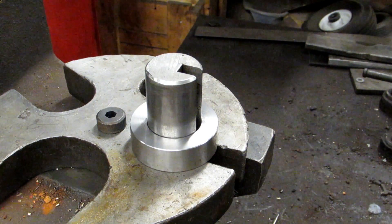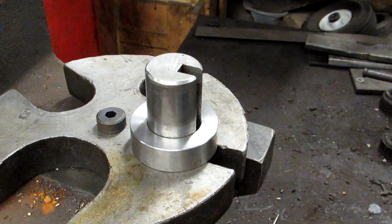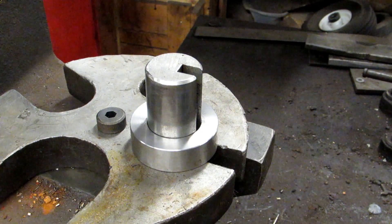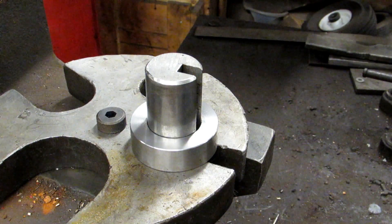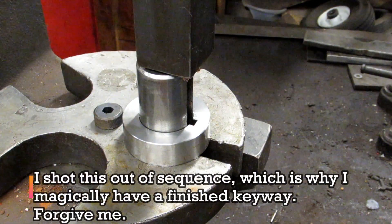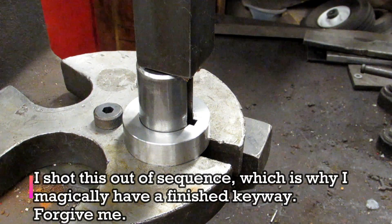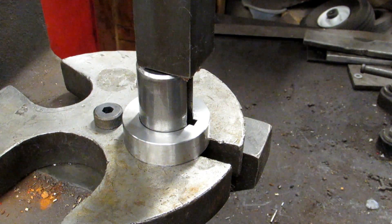You also need an arbor press or hydraulic press in order to do this. I really prefer doing this on an arbor press because you've got some feedback — you can feel what the broach is doing and you can feel when it's jammed up. But on larger sizes you really don't have much of a choice but to use the hydraulic press. This is a ratcheting arbor press which I find helps an awful lot with this. You can do it on a standard arbor press, it's just you're probably going to be repositioning things for better leverage.